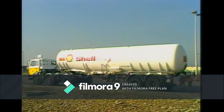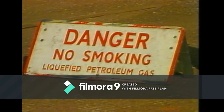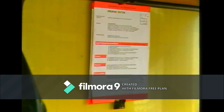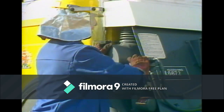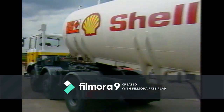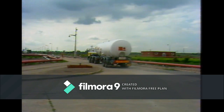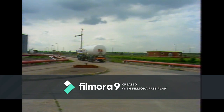Apart from the items which are fitted to the tank or vehicle body, the vehicle should also carry the following essential equipment. Warning notices, which may have symbols as well as words. Wheel chocks. Fire extinguishers. A bonding or earthing wire. Emergency instructions. Protective clothing. The safe operation of bulk LPG vehicles requires that the crew are familiar with all fittings on their vehicle and have been thoroughly trained in all safety procedures. They should, of course, obey all laws and regulations relating to road usage in the country in which they work.